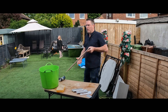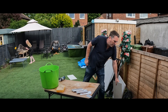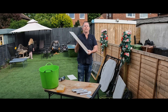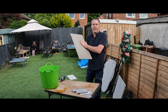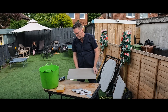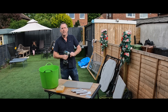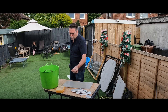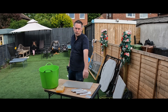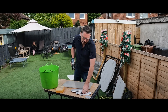That was polished porcelain. Now we're going to the textured porcelain — a ragged surface. This is demonstrating on every single type of material. It's not solid — it's a bit more tricky. What you do is save those used bits and you can still drill ceramic tiles with them all day long.